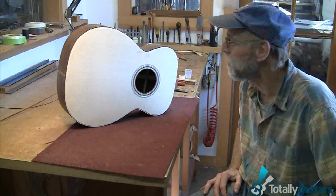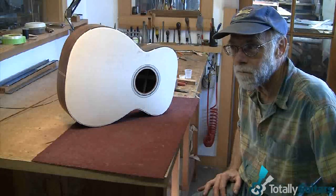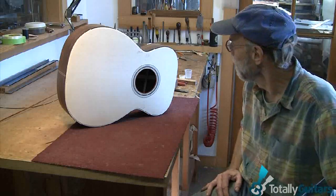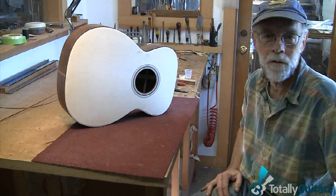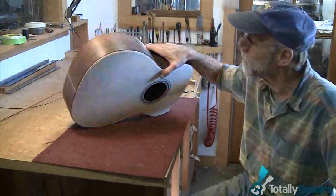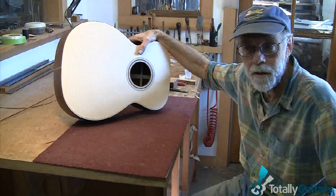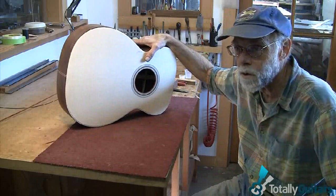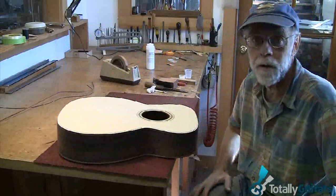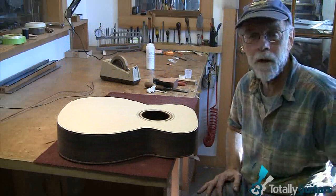The hardest part is finding a good quality case that fits your guitars these days — that's kind of what I'm working on now. This guitar will be built probably in another two or three weeks depending on what happens every day. Then it'll go into the finishing process, which will take about a month — I give it a good three weeks. The sides and back will have a nitrocellulose lacquer, and the top will be French polish with shellac. Almost all the guitars I make these days have a French polish top instead of lacquer — it's very thin and very helpful to pulling the tone out of the guitar.